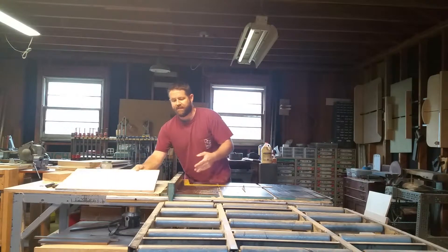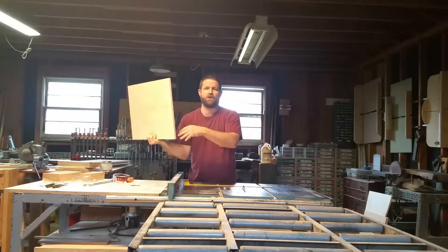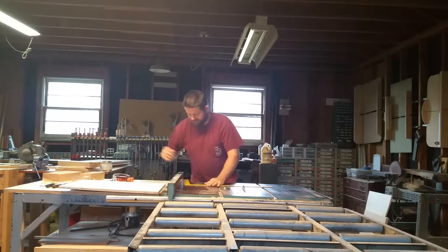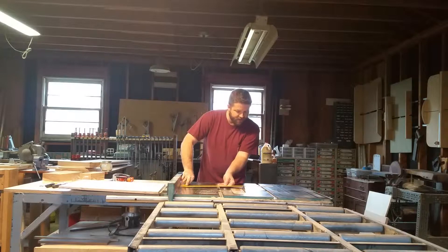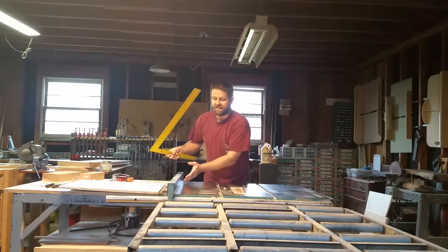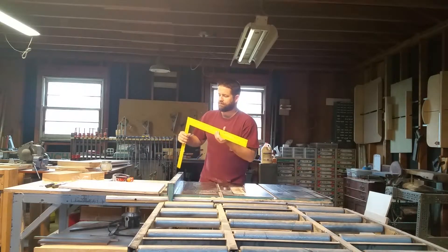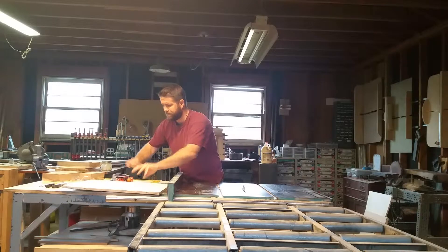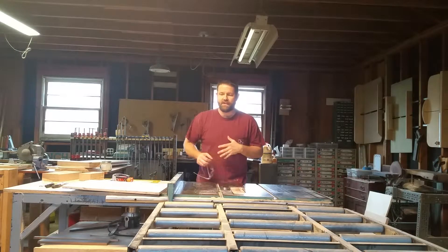My mirror box is 16 inches high, and I always cut pieces just a little bit long — right now it's 16 and an eighth — so I have room to trim. I'll set my fence to just over 16 inches and use a square to my saw blade to ensure I'm truly the same distance from the front to the back of the blade, confirming a square cut. Those are just a few extra steps I take — not just on telescopes but on just about anything I construct from wood. It takes longer when filming, but in a normal workflow it goes quickly.